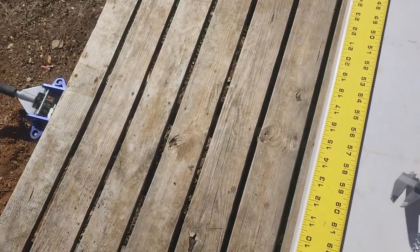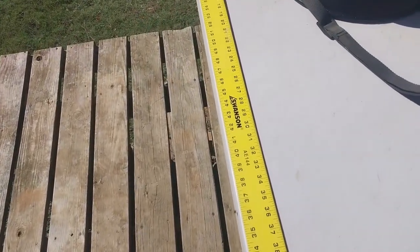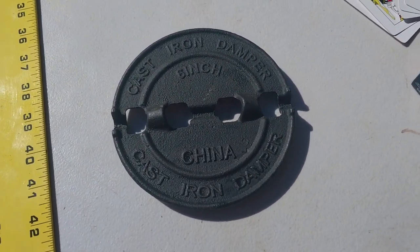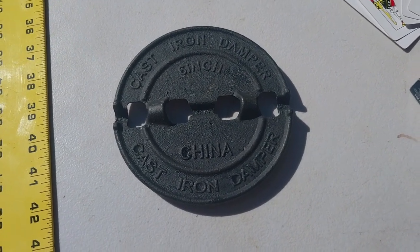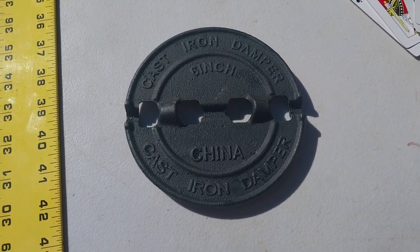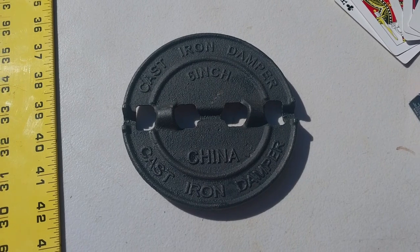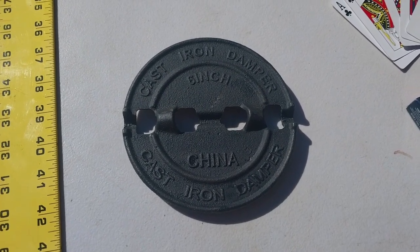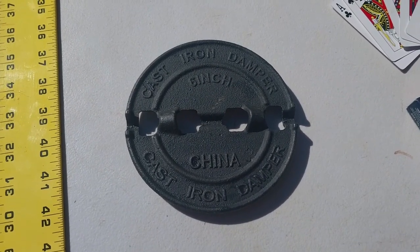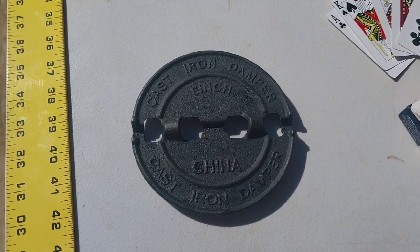What we're going to do is get this hole made for the damper. The damper has two parts: it has the plate itself, which controls your airflow. This is very critical on a vertical smoker — on any kind of smoker, your exhaust air determines the vacuum on your stove. Whether it's a wood stove for the house or for cooking, your top stack output is what makes it draw. That draw is what pulls air in. More air volume, more air speed. When the damper's open, you get more air volume, more oxygen, more heat. So this does your coarse adjustment of heat on the wood stove.